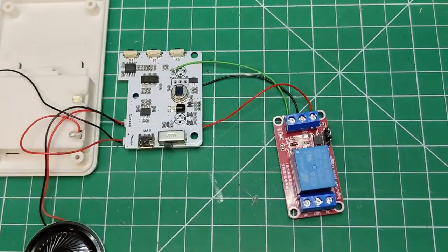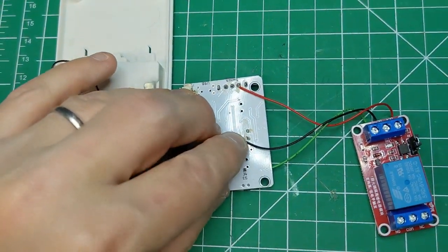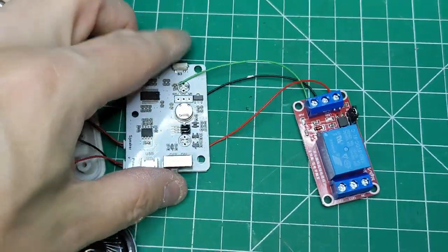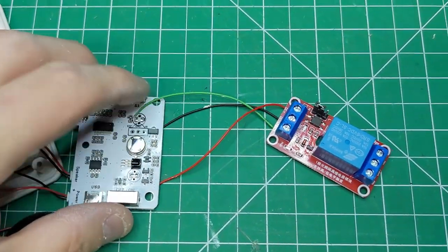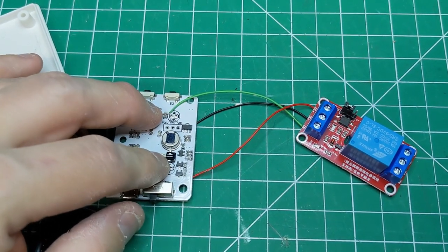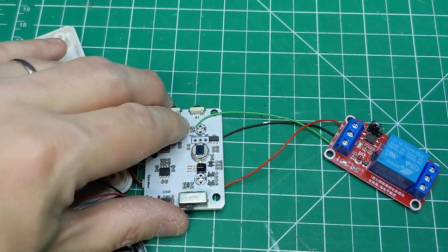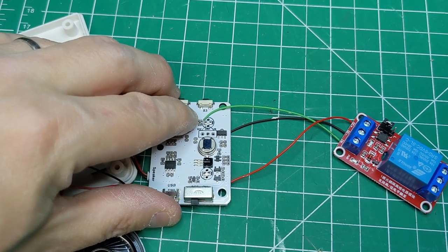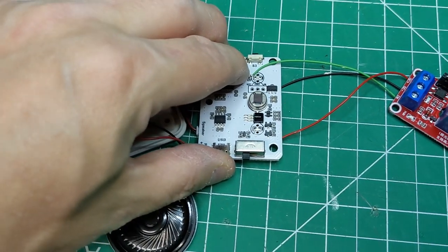I've got a relay hooked up. Using the sensor output directly from the back of the PIR was quite unreliable — getting false triggers and half-triggers. But what I noticed is that every single time it triggered, the two blue LEDs lit up. The circuit driving those LEDs is pretty simple — driven high or low from the controller. I found the end of this resistor here goes high when triggered and off when not, hence the LED comes on. So we can use that point instead.